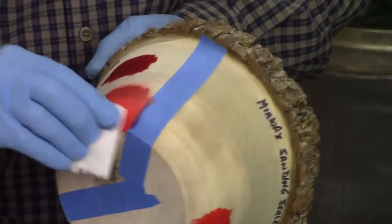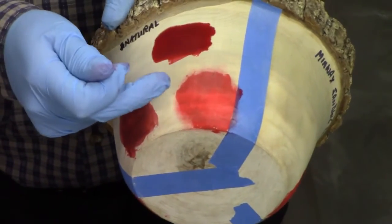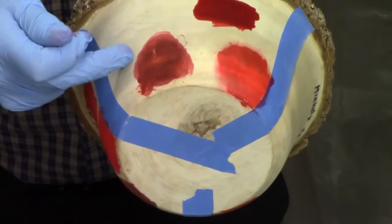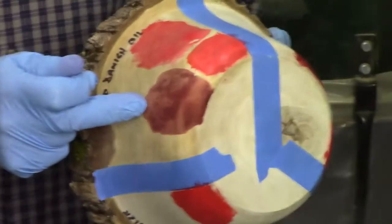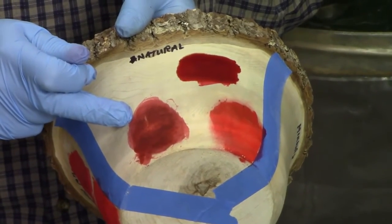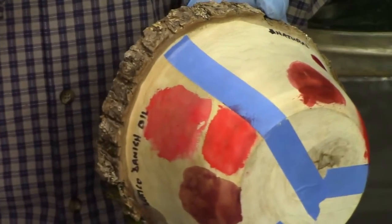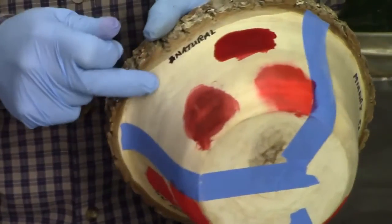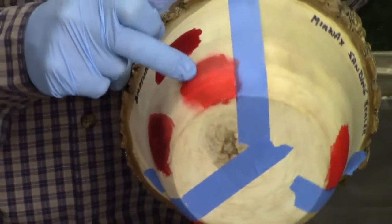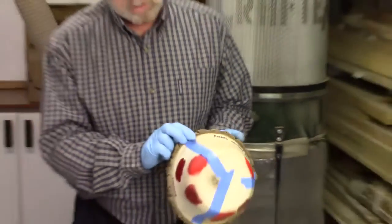And once I smooth it around, you see it starts to change color a little bit, because on the turned item, the grain going down around the edge has been burnished a little differently than it would here. The alcohol penetrated better than it did on the oil base finish, but it still shows the grain differences more. So on all of these, you can see on the Watco so far, oil-based was the strongest color because we're putting oil over oil. With unfinished, water-based, water sunk in, was absorbed much more readily. The oil didn't get absorbed quite as much. The alcohol absorbed in, but it absorbed into the softer areas quicker than it did the harder areas.